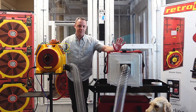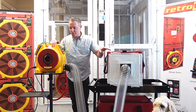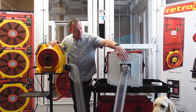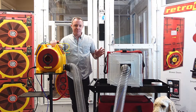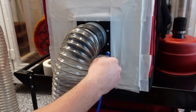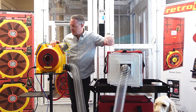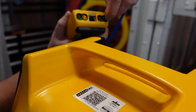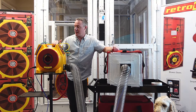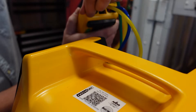Today we're going to demonstrate how to run a test with the equipment. We're using this duct simulator case — modified to behave like a duct system. We have our system connected with our flange, and everything sealed off. The flange has a blue port built right in where you measure pressure inside the duct system. A blue tube connects there and comes back to the blue port on the DM3220. Then we match colors from the gauge to the fan — yellow port on the gauge to yellow on the fan, green port to green port using the green tube.